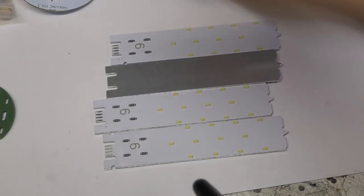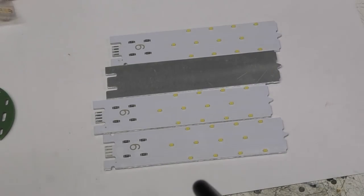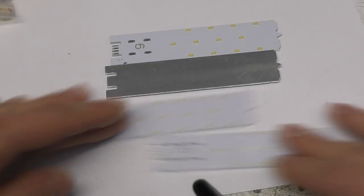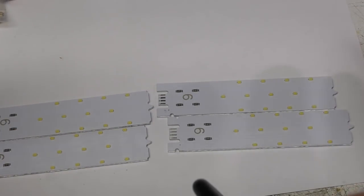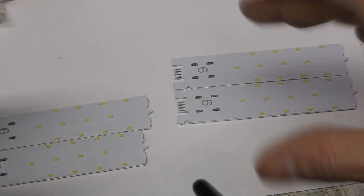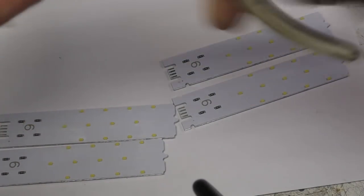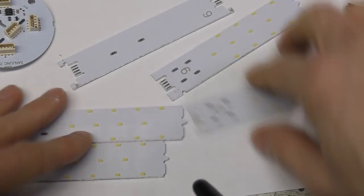Now we had 3 different sizes of these for 6, 8 and 10 inch cubes, and the installation was all pre-designed, so we knew exactly what proportion of strips we needed. So I spent quite a lot of time trying to design a panel to get the right proportion of strips on the panel. Unfortunately they changed the design later on, so I think we ended up with a bit of a surplus of one particular strip, but I spent quite a lot of time just juggling the panel size versus the proportion of each of these types of strip on that single panel, because obviously we wanted to keep everything on one panel to reduce the tooling costs for stencils and for setup.